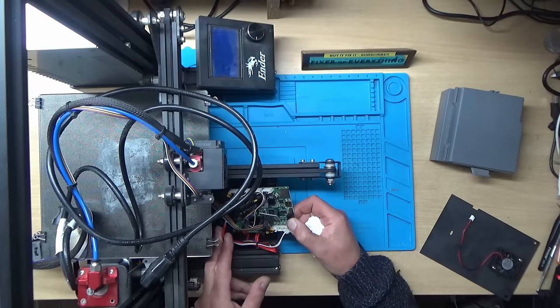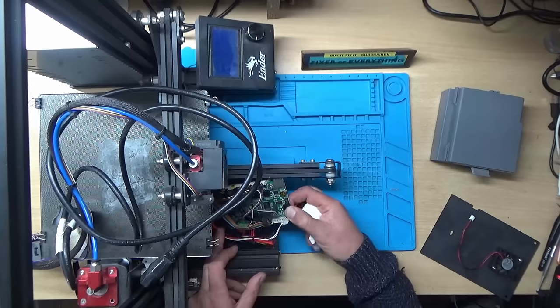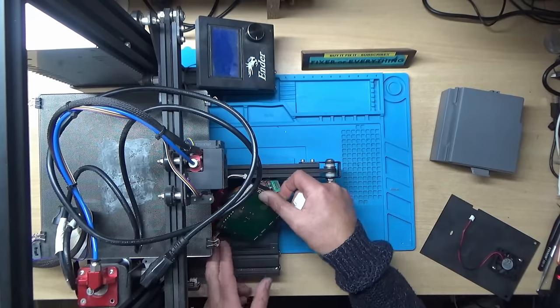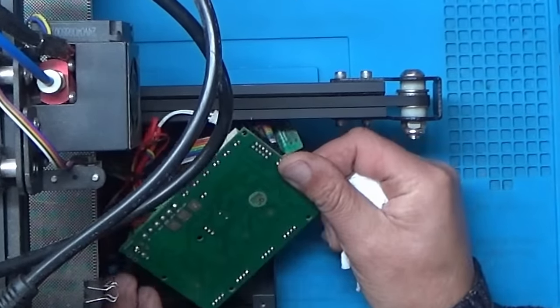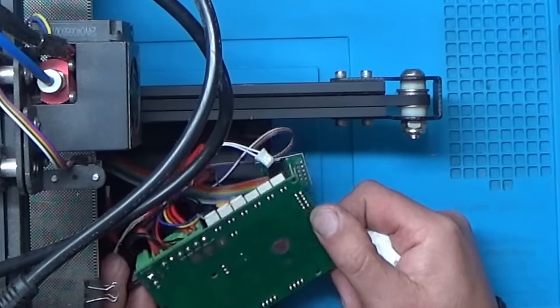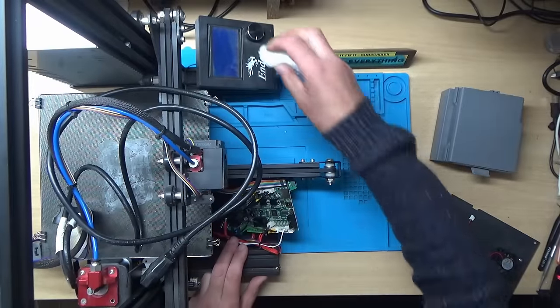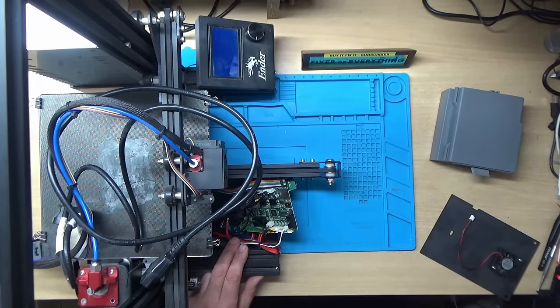There's a power wire just floating about in there as well. I've got negative and positive on the bottom here, but the black wire seems to be going to the positive for some reason — I don't think that's right. It's rather dusty; I think it's sat on his landing for months and he just never got around to looking at it.